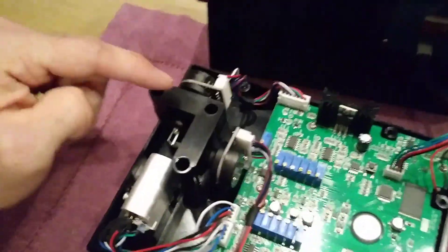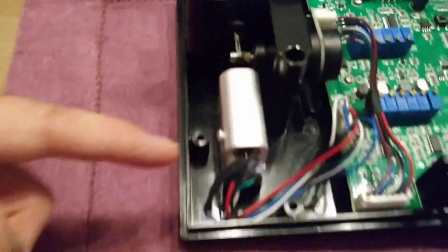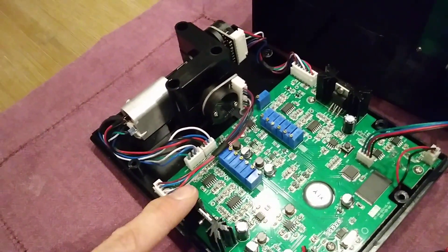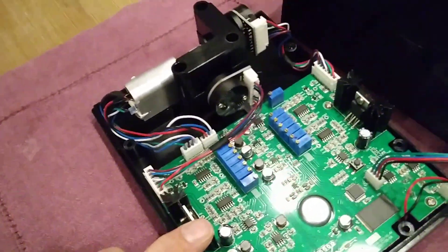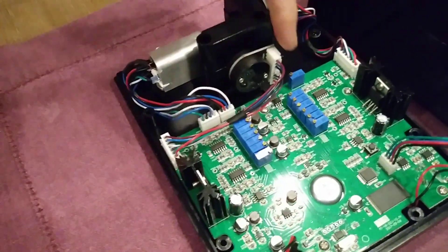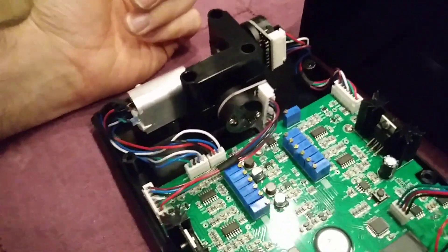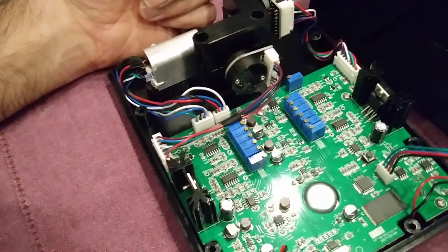You see there's a Y and X galvanometer here with the two mirrors. The laser here is a 532 nanometer DPSS — pump diode pump laser — and it is exactly like most of the galvanometer-based light shows, which include a power driver for both axes and all the adjustments here. That's pretty interesting. And also you have this potentiometer right here, which is actually adjusting the power for the laser. Because of the regulation of different countries, you cannot use a laser above 5 milliwatt unless you have some class and instruction.